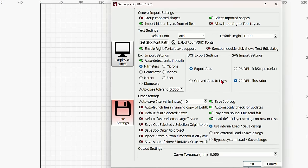So what happens here? It's gone further than the boundary of your laser, and you will get the dreaded error 9, and the laser will stop the job, and you'll start scratching your head as to why. So you always want to be careful of those outer boundaries, and you always want to do a preview. If we move it to there, you'll see that it's perfect. It will not cross that outer boundary of the edge of your laser, and you will be able to run this job. So that was just a point that I wanted to throw in there.